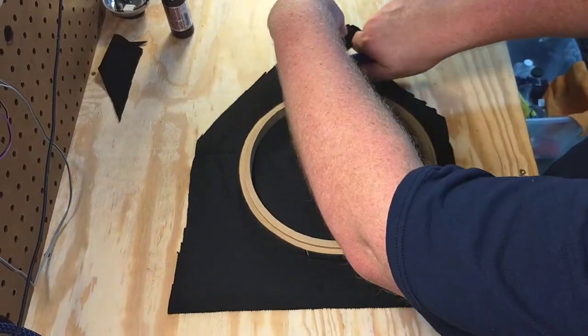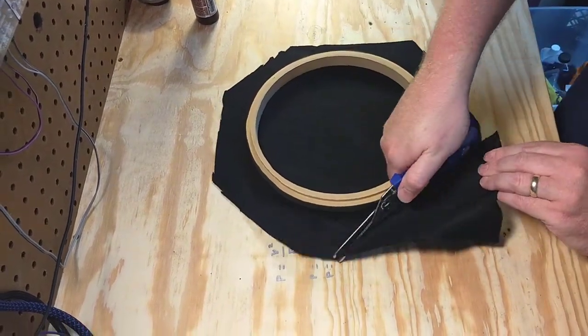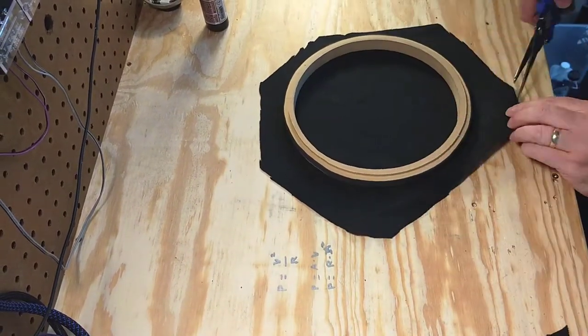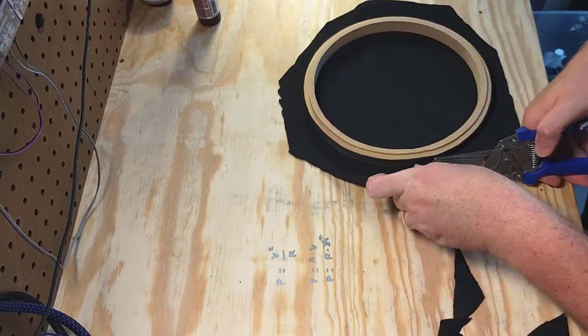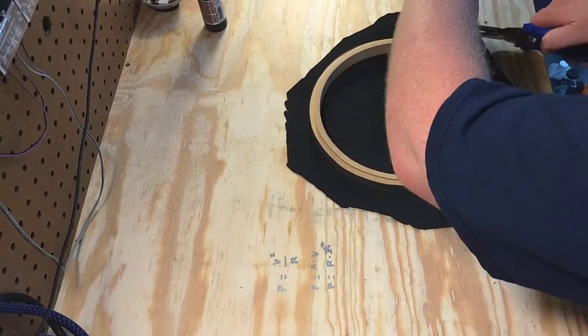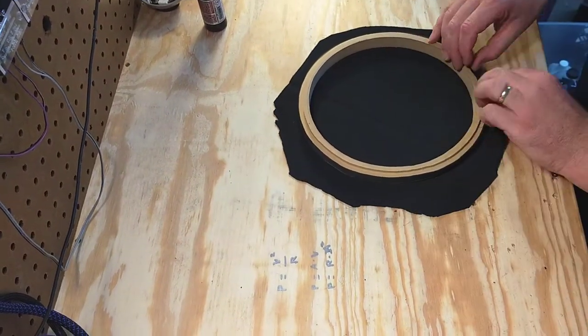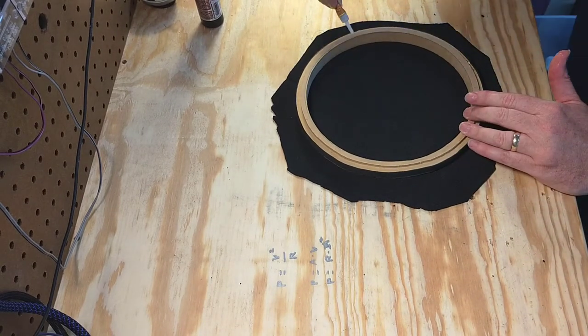This is quite literally the first time I've ever wrapped a project with any kind of material. In fact, this was an extra ring that I made just to use as a practice piece. So you get to watch as I awkwardly cut out far too much grill cloth material and struggle to affix it to the ring. I cut a rabbet into the underside of the ring to make it easier to attach the cloth. I'm using super glue and staples to hold it all together.